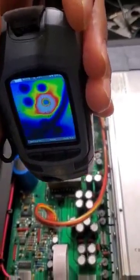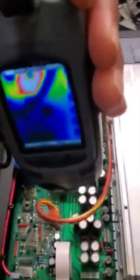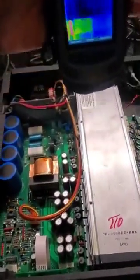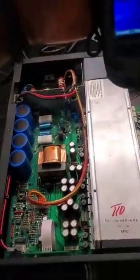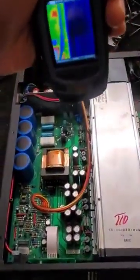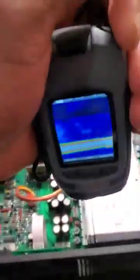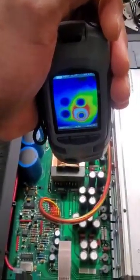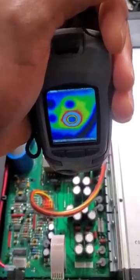I'm going to show you — not just with the thermal imager, but I'll take the phone down there so you can actually see what I'm talking about. This is just a quick way to see where you're getting heat from. I'm going to go over the heat sink. The heat sink hasn't stayed on long enough to really start to show red, but when it stays on long enough, that heat sink will start to get red. And we'll go back to those caps — that bank of caps is very hot, but the white around it is slowly getting smaller, meaning it's starting to cool down.